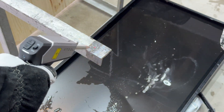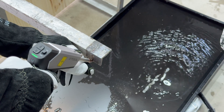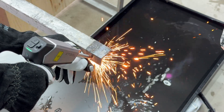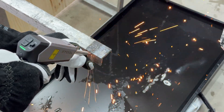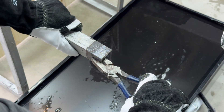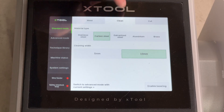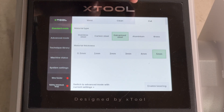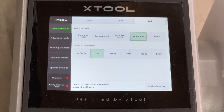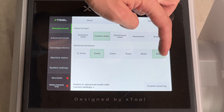Note that I'm always cutting downwards — the last thing I want is to face the laser out into the distance and ignite something far, far away. Making these cuts is extremely simple; they're very precise and very clean with basically no slag. I also love that I don't have to guess what power to set — they have on-screen presets that I just click and all the settings are correct. It makes cutting other things really easy without having to tinker for the best settings. Good job xTool — I approve of this awesome user interface.